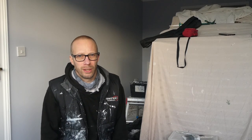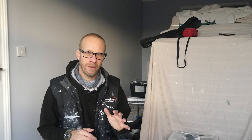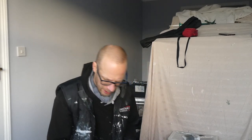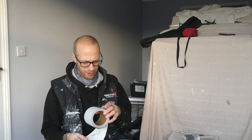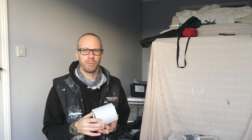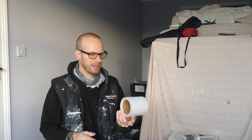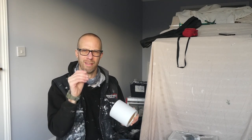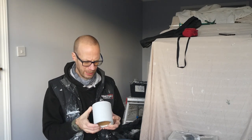It just leaves me now to finish the woodwork. So it's all been undercoated and primed. So all it really needs is a very light rub down. And for that, I'm going to use this 180 paper just to give the undercoat and primer a very, very light rub, just to get any bits off the top, just to give it a very, very slight roughen up. So when that top coat goes on, it'll be lovely.